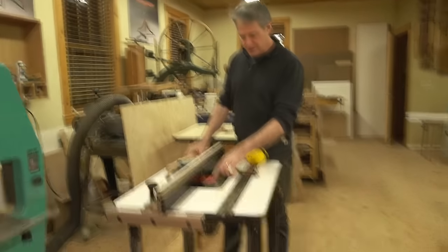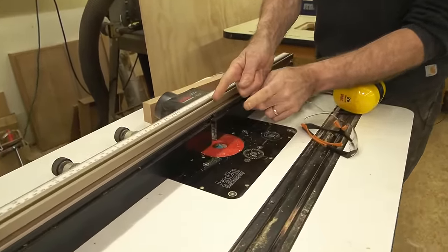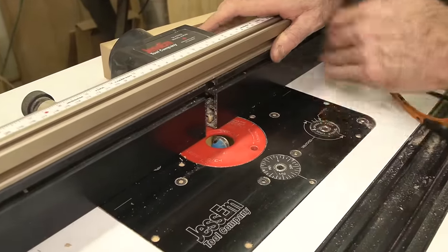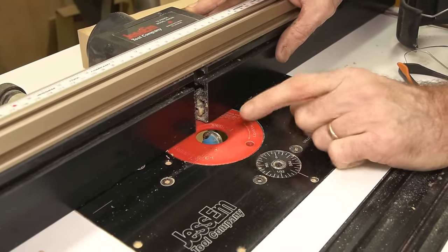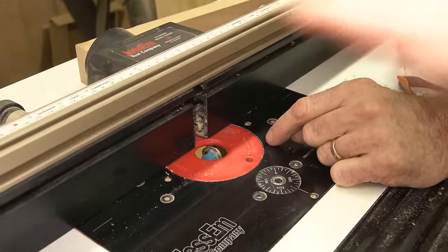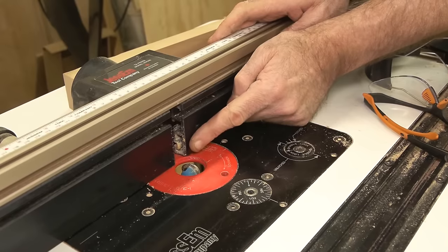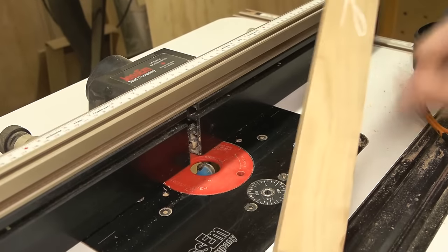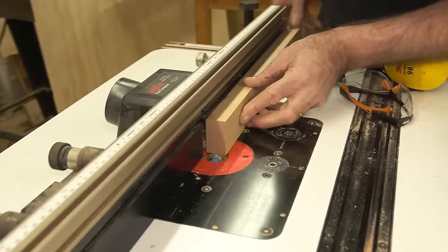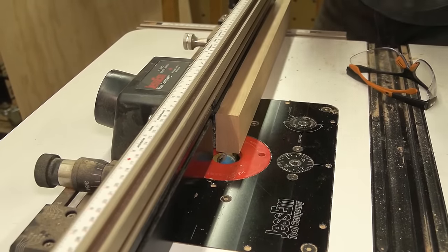So there's that bit — it's seven-eighths in diameter. You could use a one-inch diameter with a nose; I believe it's called a core box bit so that you could plunge and make a rounded hollowing out of something. All right, so this is going to be our groove. I've got it set one half inch from the fence. So we're going to run this board through with the face against the fence. I'm going to come in right like this and cut this groove — that's going to be about a sixteenth inch deep, both sides. Here we go.